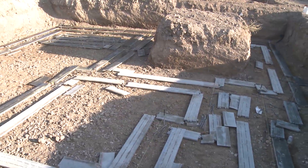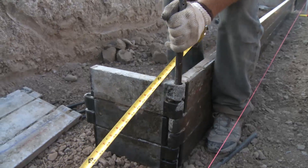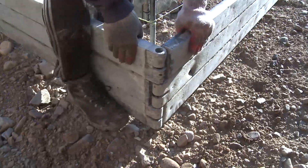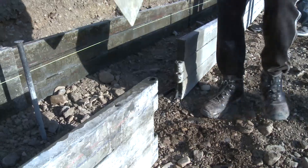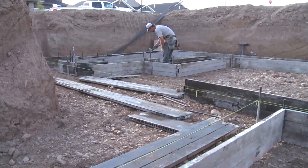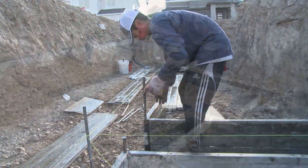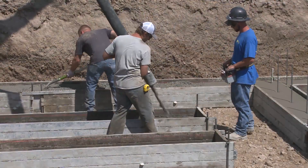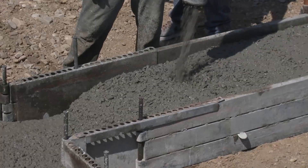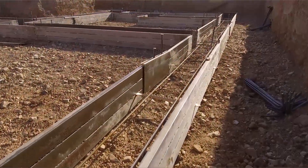My name's Chad Watterson. I work for Western Ridge Concrete. Typically when I lay out, I lay out to outside of foundation, and when we build them we just measure off of our outside of foundation. They all go together — they all have tabs on the end that stakes go in, you drop the stake in, check it, and drive the stake. Because of the process, it saves a lot of time. If you replace a set of lumber every year, it costs you a couple grand. With these, if you take good care of them and keep them oiled, they'll last you upwards of 2,000 or maybe even more pours. If you're looking for efficiency and production, there is no better way to go. They're far and away the easiest form system you could possibly come across as far as time, efficiency, and effort.